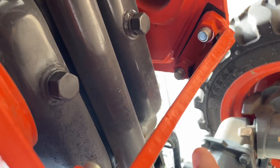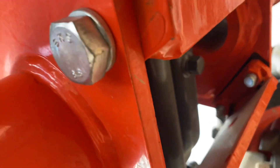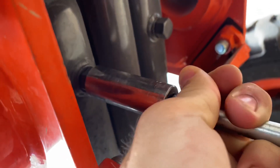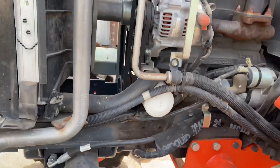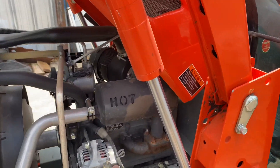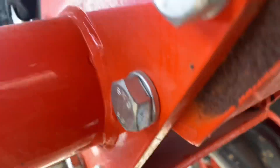There are two drain bolts on this thing — kind of a stupid design. The driveshaft runs through the center of the oil pan, so there are two separate drain bolts. Those are 17 millimeters, but there's a lot of paint on them so you have to wiggle the socket on there. I believe they're Japanese — pretty sure — but 17 millimeter. Let's get the oil draining.